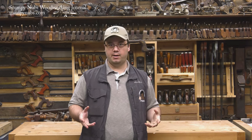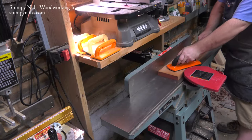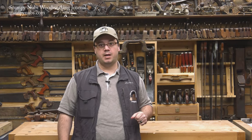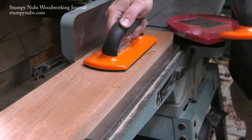It's a pretty good argument for buying a new cutter head. But if you're going to make an informed decision, you need to know the negatives as well, and there are a couple you should consider. For one thing, a helical cutter head requires more power to drive it. A head with two or three straight cutters gives the motor a split second to recover between each instance the cutter contacts the wood, but with a helical cutter head there is less time for recovery between rotations. So smaller machines will bog down easier. This can be avoided by taking a lighter cut with each pass, but it was still noticeable on my machines — not enough to make me regret the decision, but still noticeable.